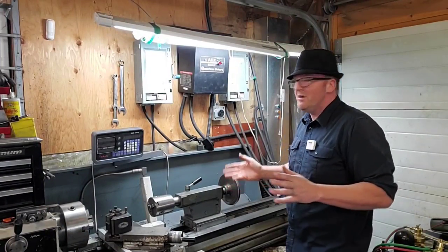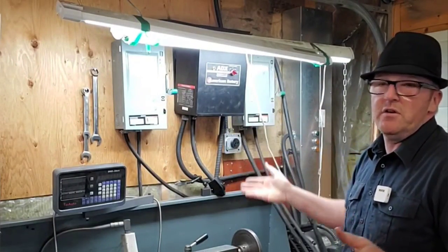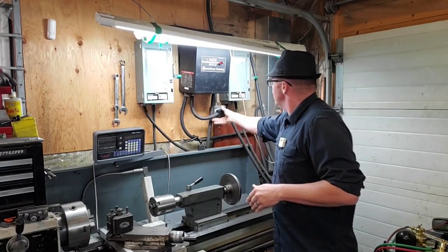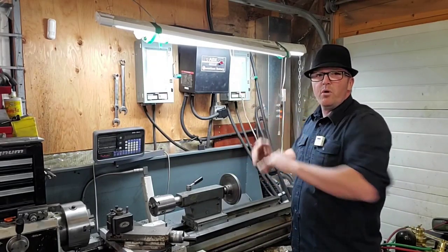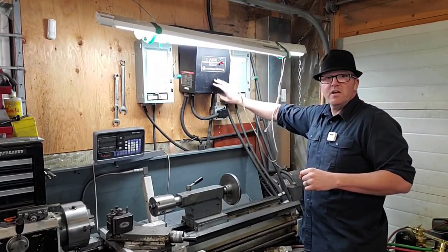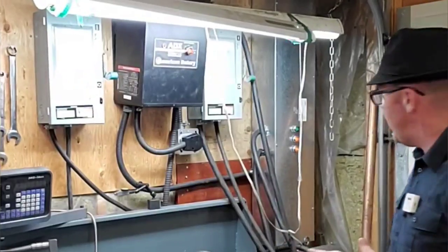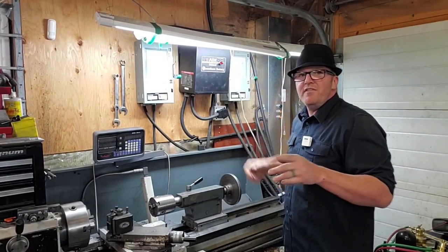Let's look above the lathe at the phase converter setup. I've got an American Rotary phase converter — a 15-horse unit, which means I'm good for up to 7-horsepower motors. I've got a 220V line, I believe a 50-amp line, running into it. I've gone this portable route because I'm a small shop and might expand — I don't want to wire it directly into the shop. Once plugged in, power goes up to the phase converter and into the splitter. You can see two orange indicator lights, and when I turn the third phase on a green light confirms it's operating correctly.